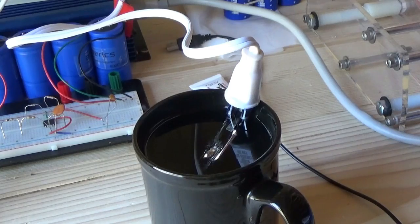It is heating and we're only using 100 watts. Now, it's rated for 200 watts of power but I'm only pulling 100 watts off the solar panels because we're still in absorption mode. Right now I've got 600 watts total capacity, so this isn't going to phase that at all. It should be easy to stay in absorption mode.